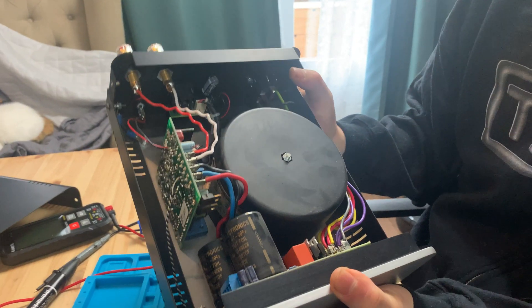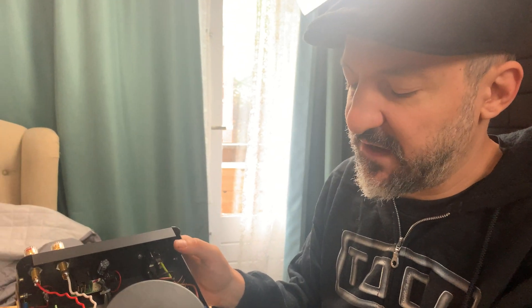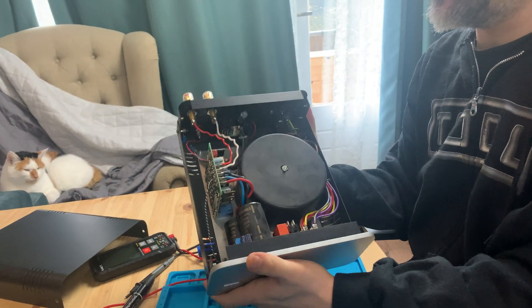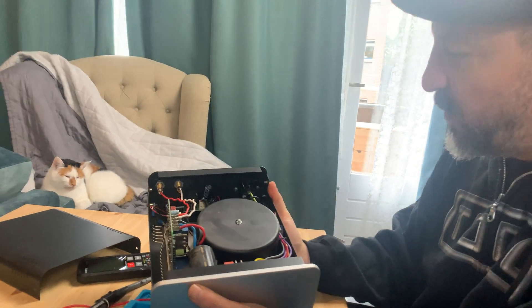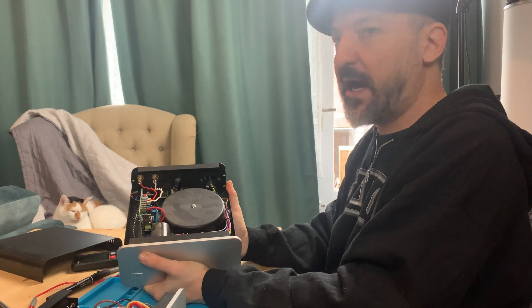Because the switch is deactivated, I've been working on replacing the functionality by putting a bridge here and here, then tying a wire over to a different plug and putting a jumper there. I'll be making a video showing how I did it. This one is 300 watts, rated for 4 ohms — I'm pretty sure it'll go down to 2 ohms.